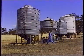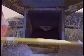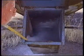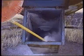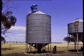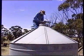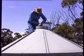You can also use inert dusts for pre-treating machinery and empty silos, as well as protecting stored grain. First, clean out the silo, then blow inert dust into the outlets. Next, blow more in from the top access holes to coat all internal surfaces. All you need is 2 grams of dust per square meter of surface.